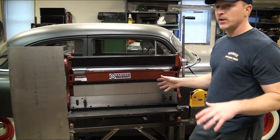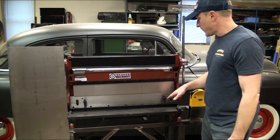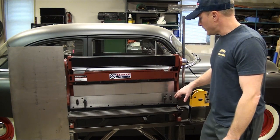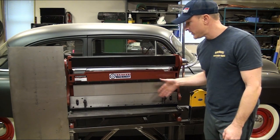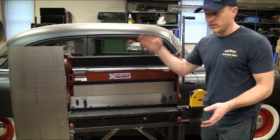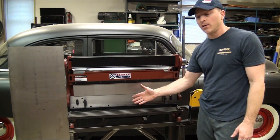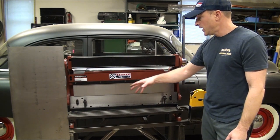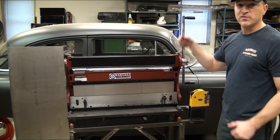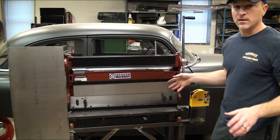I'll try to keep it short and sweet because there's not a whole lot to these things. When you first get it, just like any machine, you'll need to do some alignment. The instructions that come with it are horrible, but if you just stare at it for a bit, it's not too bad to figure out. Make sure your blade is square to the cutting surface — there's adjustment on the back. I put a couple pieces of cardboard in and made a few cuts to make sure it was cutting straight before putting any steel on it. There are also grease fittings on top. The handle barely moves when you first get it, so hit the grease fittings, slide it around, grease it all the way around, let it set, and then it becomes very easy to use.